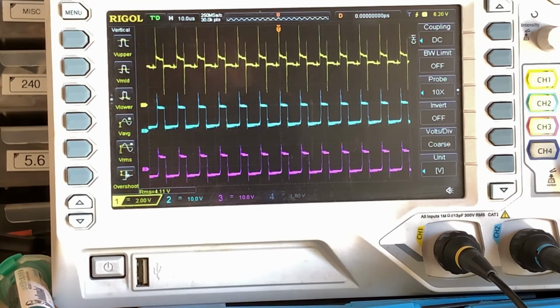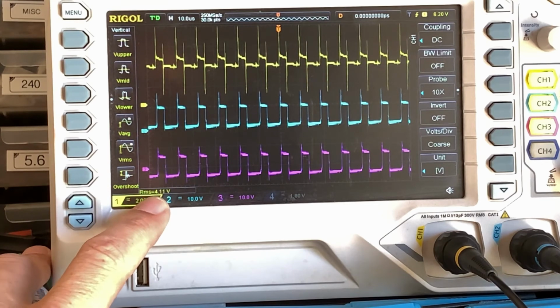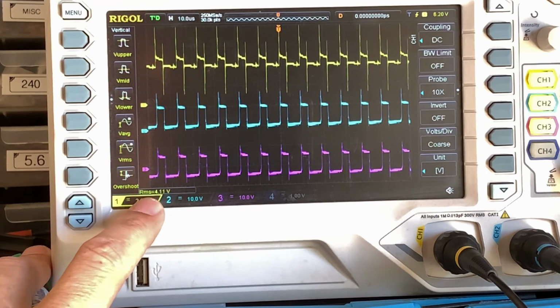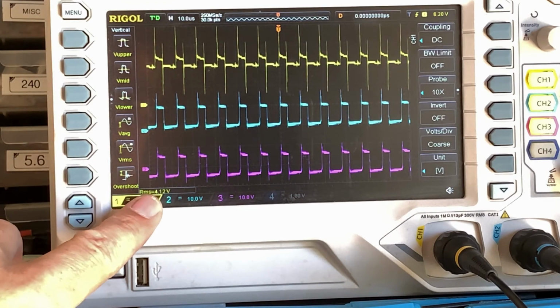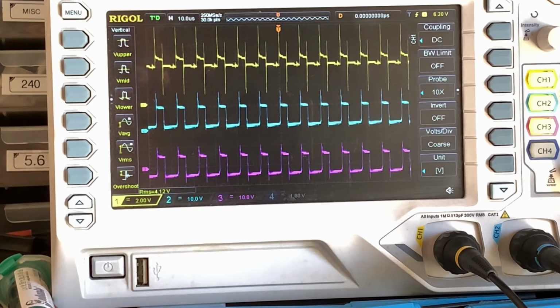Right, so it's been charging a little bit. Interestingly enough, the only thing I want to bring your attention to is our output voltage to the battery. RMS voltage 4.11 volts. It's coming up. If you remember, it was 3 point something, 3.2, 3.6, somewhere around there. Slowly but surely the voltage is rising. It just means that the current draw from the battery side, from the phone, is becoming less and less, and we actually are charging our cell phone.